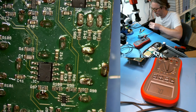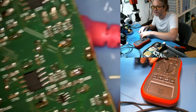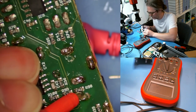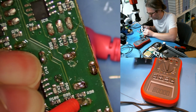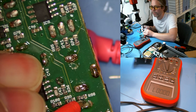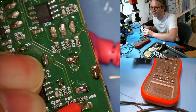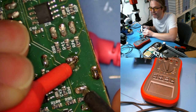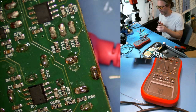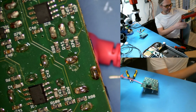The next question is to make sure the switch actually works. To do that I'm just going to attach a jack. What this should do is actually separate these two pins, and we should no longer be getting 6.8k. I was measuring the wrong connection at first — there we go, 200k and climbing. So that's just other parts of the circuit interacting. Alright, I'm going to say that looks successful.